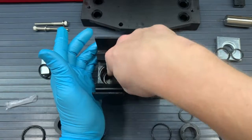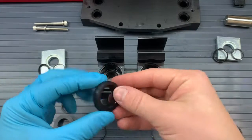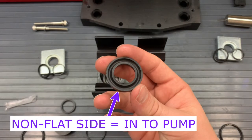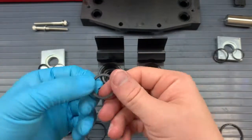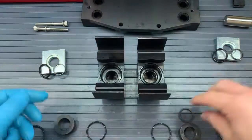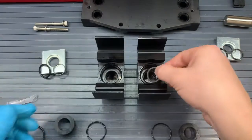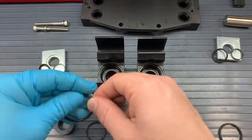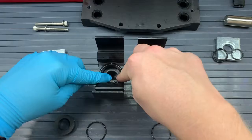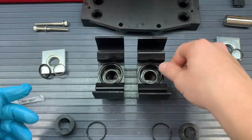Next is the U-cup. It might be a little rigid at first, so it might be hard to push in. We're going to take it and put the flat side facing out, so the wider edge with the ridges goes into the pump, as seen here — get that as far down as you can. The support ring should fit perfectly in there; the rounded edge on the support ring fits on the rounded inside of the U-cup. Next we will take our large O-ring, the 124 O-ring, lightly grease it with the grease from kit A, and place it on the opening of the seal bore.